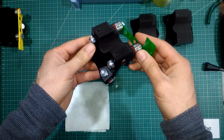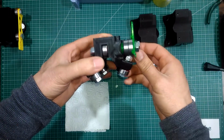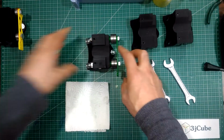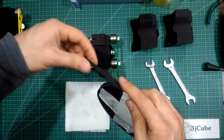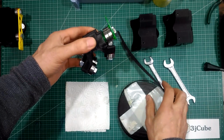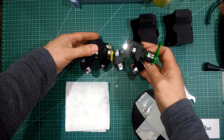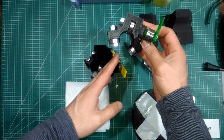As you see, this is the assembling according to my modification, where 2 bearings will be better for seating the 10mm width belt, and also, as a comparison, if you can see, the ruler will not hit the supporting of the tube.